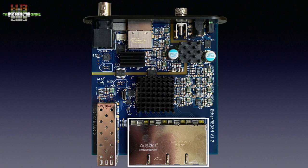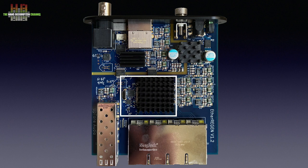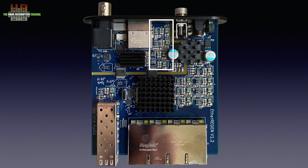The A side holds the four ethernet ports module with integrated magnetics and transformer cores — the first line of defence. To the left is the SFP cage. Below the heatsink, the ethernet switch electronics, format converter, clock buffers, and ultra-low-jitter differential flip-flops are hidden. The power regulation for the A side is situated here. The B side is fed by the isolating DC converter, while further ultra-low-noise voltage regulation takes place here. Once the network signal has passed the isolators, it is sent to the B side ethernet switch electronics, format converter, clock buffers, and ultra-low-jitter differential flip-flops. These are controlled by the ultra-low phase noise CRYSTEK CCHD-575 crystal oscillator and Silicon Labs jitter-attenuating clock synthesizer, unless the clock switch is set to external, in which case the external clock signal is used.